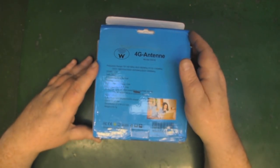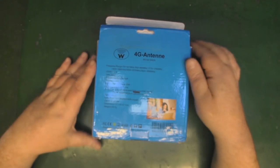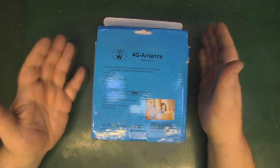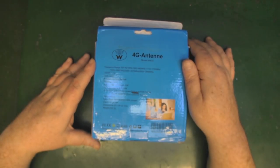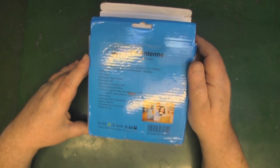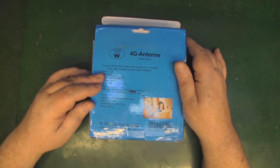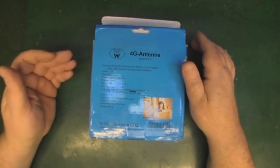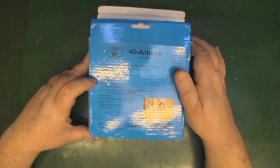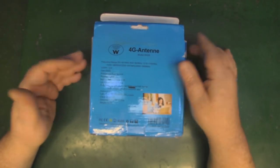I've been sent this antenna by one of my subscribers who purchased it and asked me to take a look. It's a popular one on eBay — a whole host of sellers do sell this antenna. It works from 791 megahertz all the way up to 2.6 gigahertz, quite a wide range. The VSWR of 2.5 is a little high, and so is the claimed gain of 35 dBi. Polarization is vertical and it's an omnidirectional antenna.